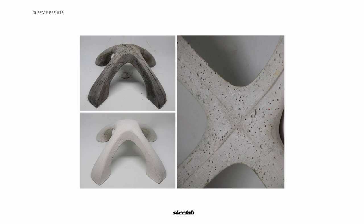Overall, we were pretty happy with the consistency of both concretes that we mixed. We were happy with the white concrete — the Circrete — because it was a little stronger and smoother. We also started to notice exactly what we were predicting: micro bubbles that created air pockets within the mold were not able to come out. So while the top was smooth, the bottom kind of had a moon-like crater surface.